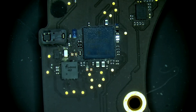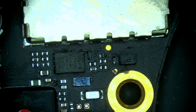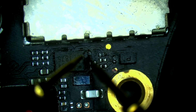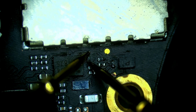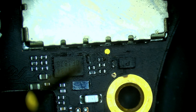I'm just gonna do a quick clean on the bottom side of the board here. Alright, we got some ugly looking resistors over here. The two that are not looking good, they're supposed to be 3.3 kilo ohm resistors. Let's test them. That one's good, but this one is not good. What we're gonna do is replace all three of these anyway.